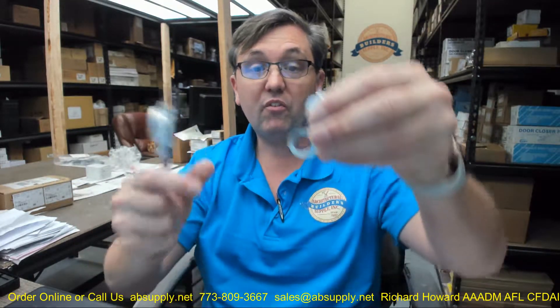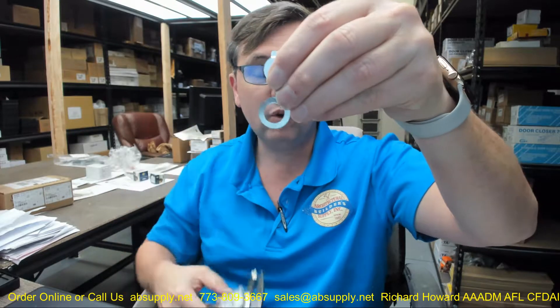Some dimensional properties — this may or may not fit your item, but let's give you the dimensional properties to determine that. The most important aspect would be the ID of the hole that your viewer is going to pass through, and my caliper tells me it's .549. So if you have an item that has a half-inch body, it's going to work. One that takes a 9/16 hole — this isn't going to work. This would be for your smaller door viewers.